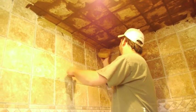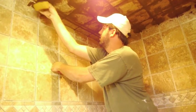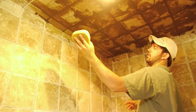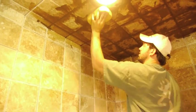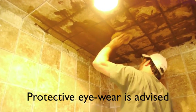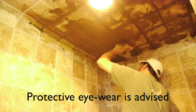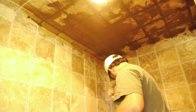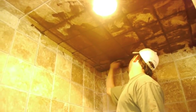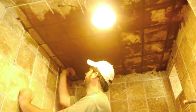Come back with a clean sponge, wipe again, turn it over, wipe again — two wipes, then rinse. Another way you can do it: get the sponge and go ahead and wipe it all down this way. What this does is spread the grout all over your tile, push it up into holes — everything is going to wipe down and should wipe off easier now.